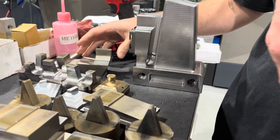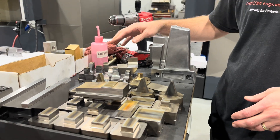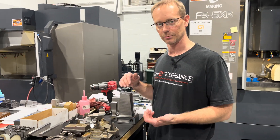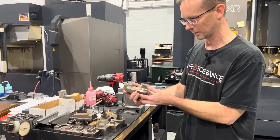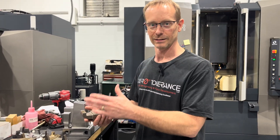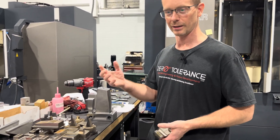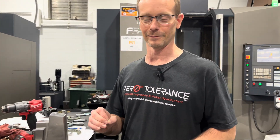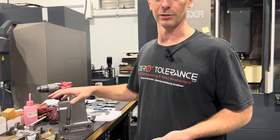Here are the results of utilizing the 5x Factor — going above and beyond even the 5-axis, where we mount it on other machines and do all the other operations. We're going to end up in the wire machine, where the second-to-final operation is to cut off the detail in the wire, take it to the surface grinder, dust a couple thousandths off if you have that much on there, and end up with a product that was touched by hand very, very little — trying to utilize a hundred percent of the fixturing and all the multi-axis machines that you've got.